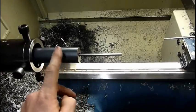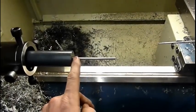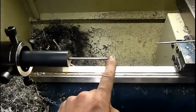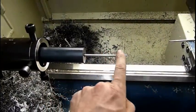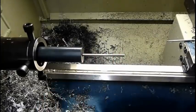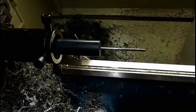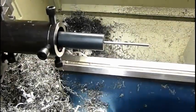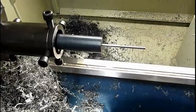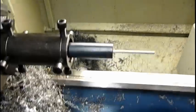What's really important is getting your threads and your chamber perfectly square to your bore. You do the same thing — dial in here and center it with the front one, then dial in over here and center it with the back one. You just keep doing that back and forth until you get this running perfectly square, centered. And then once you're done, it doesn't matter what the end of the barrel is doing — it's going to be up or down or wherever. When you thread it into your action and headspace it, you time the barrel so that if the barrel does have a bend, the barrel is pointing up — it's timed and indexed.